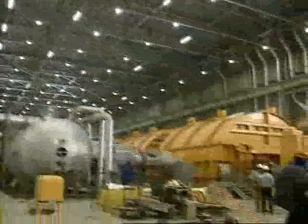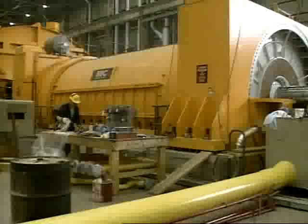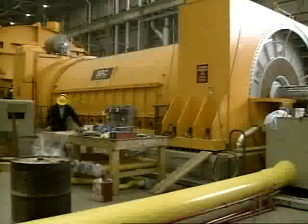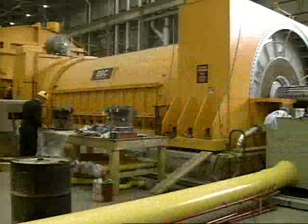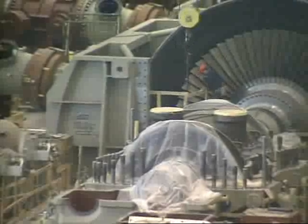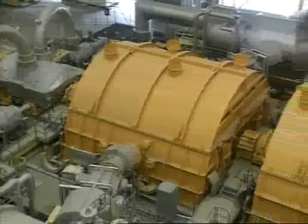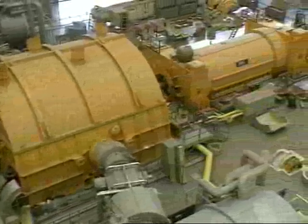This is the turbine hall. Each of the four reactors on this site has its own electrical generator, each capable of generating 935 megawatts of electrical power — by ACME's calculations, that's enough to make 1,500,000 slices of toast simultaneously. The generators are big, but they're dwarfed by their steam turbines. A turbine is just a windmill that's operated by steam. Steam leaving the first turbine still has some energy left, so it's fed to another turbine that twists on the same shaft; the second turbine has larger blades to recover energy from the expanding steam. Altogether, each generator has four turbines on its shaft.